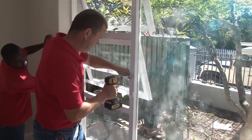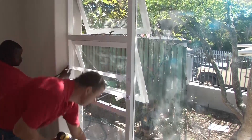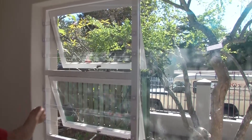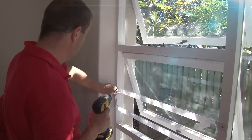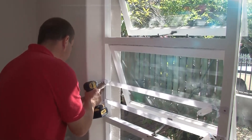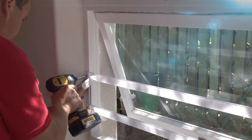Once the polycarbonate strips are prepared, installation can begin. The strips must be carefully spaced across the window gap. Work out your spacing to get equal gaps between each strip across your window, then cut a piece of polycarbonate to the correct size and use that as a spacer. Unevenly spaced strips will not look good. Do a dry run before you put in the screws on the first window to be sure that your spacing is good.